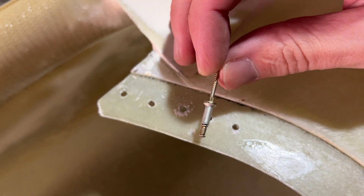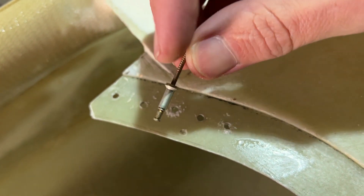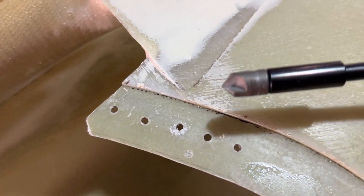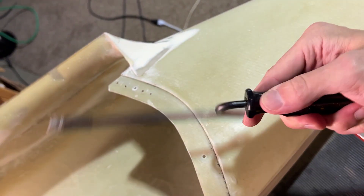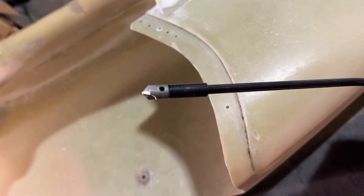I'll be using this pop rivet. You can see that it has a tapered fitting on the top because when the rivet goes through this flange, it needs to sit flush with the surface. To get that cone shape, we use this little spinny-do — it's a device with a tapered head cutter on the end. You sit there and flip it around and it cuts you a nice tapered hole on the top.